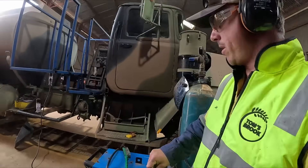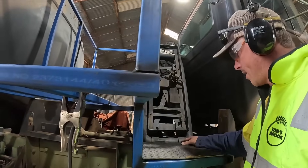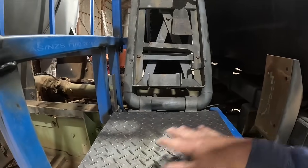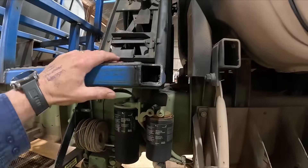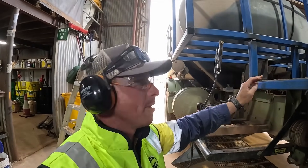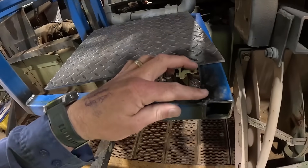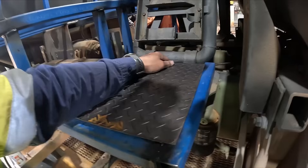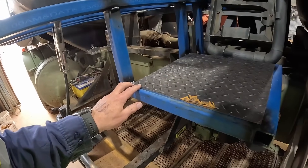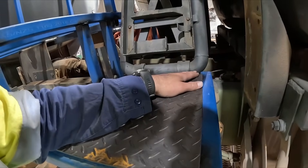Back to the shed — one-step platform ready to go. That's going to go on there like that. There's a little bit of discrepancy; I obviously didn't weld it at the squarest considering it was sort of just thrown up there. What I'll do is get the grinder and just take this weld down a little bit. I'll tack it and then stand up there and see if it bends down — if not, I'll just hit it down. I'll tack that back corner and make sure it's all sitting down properly.